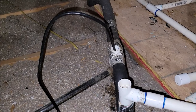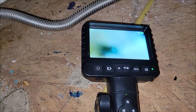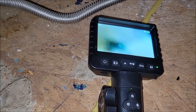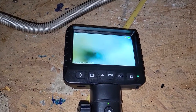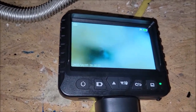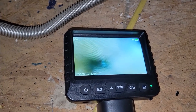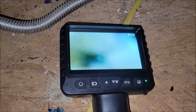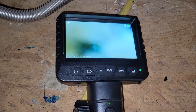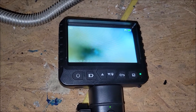So let me go the other direction and find out why the primary is clogged. I had to run the snake pretty far down the pipe, but found my clog. It looks like there's a T-connection down there that is hanging up and grabbing things and letting things store. It was pretty clear until I started pushing, and now I've got this just garbled look here, which means the camera got pushed into something pretty nasty that was holding it up. So I'm going to go ahead and pull the snake out and put a metal snake down there to try to clean out that clog.